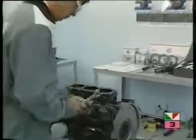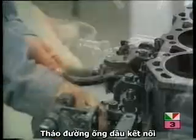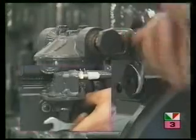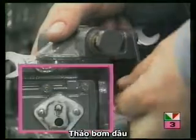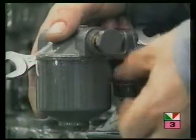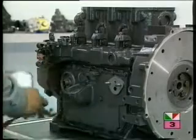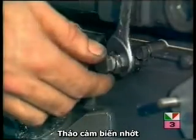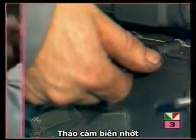Before the pistons are extracted, a number of components have first to be removed. First, the fuel pipes and rail. Next, unbolt the fuel lift pump. And the fuel filter. Unscrew the oil filter and take out the dipstick. Disconnect the oil pressure switch and adapter if fitted, and if there's a solenoid, take that off too. But make a note of the positions of the special fixing bolts.